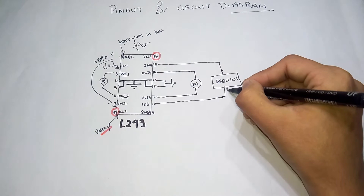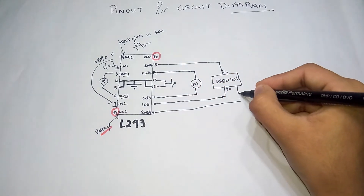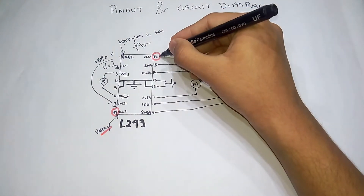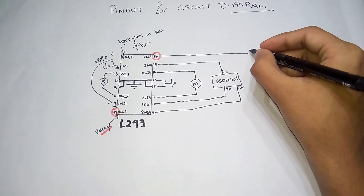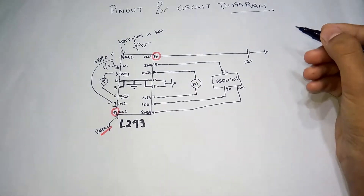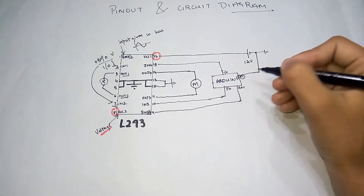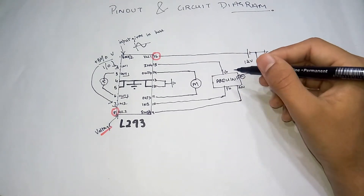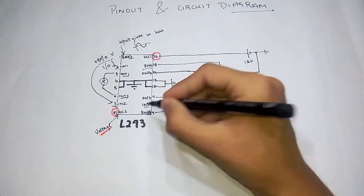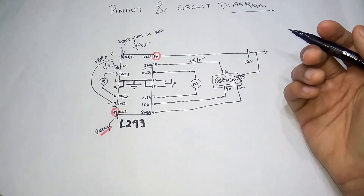Any digital I/O pins that give out an input of 1 or 0 can be used. We can also put the enable onto the analog pins of the Arduino. We'll put the VCC off a battery source of say 12 volts, and this can be grounded and also connected to the ground of the Arduino. Right now we won't be using the Arduino - we'll connect the input pins directly to plus 5V or 0V to check the motor running direction.